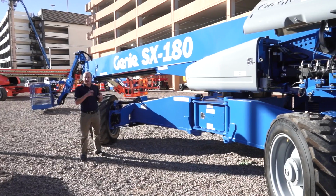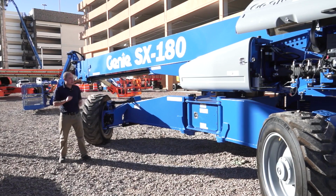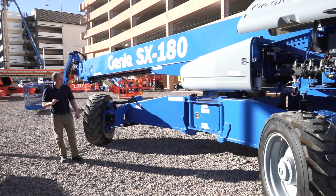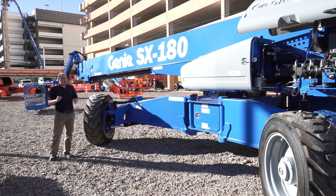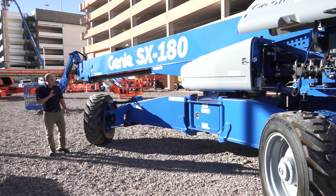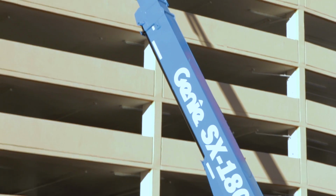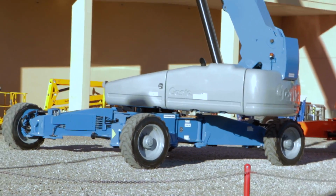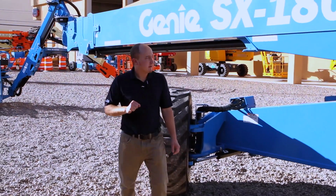by changing from a cast axle to a welded box structure. And then also some configuration changes to the chassis allowed us to achieve an even better, more efficient footprint, and allowed us to get to the 16-foot 6-inch footprint that was required to achieve 180 feet and 80 feet of outreach. This machine does weigh 55,000 pounds, so getting it onto a trailer is actually very straightforward and means that there's no over width permits, no over height permits, just overweight in some areas.